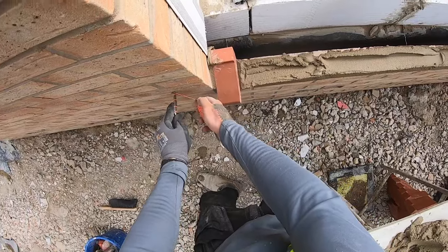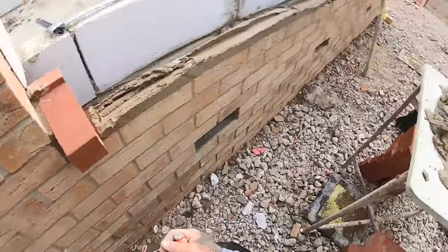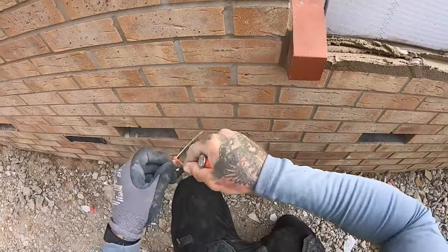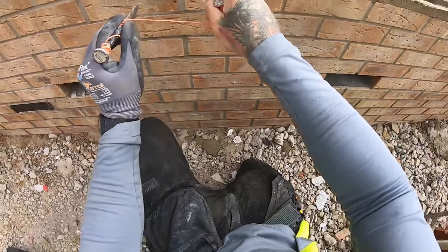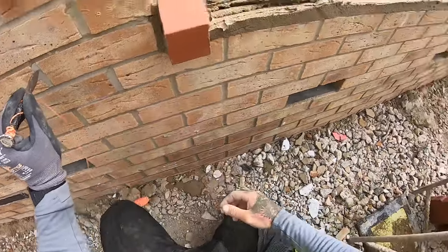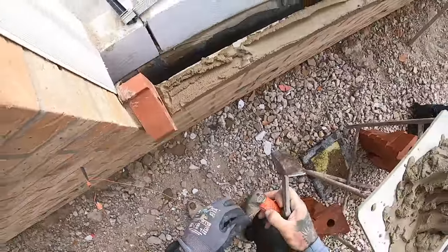about there like that, so you go into brickwork, but obviously you want a line across the front here. So what you do, pass my hammer please, Tom, is you go probably about halfway through the pin, and you'll just eye to where this point is, which is about there, drop the pin, bang it in roughly, and take it down the other end.